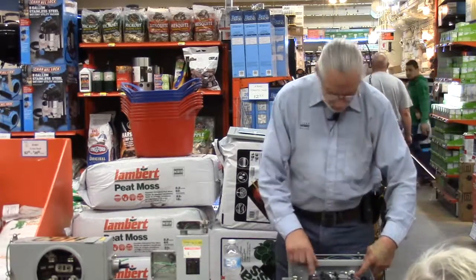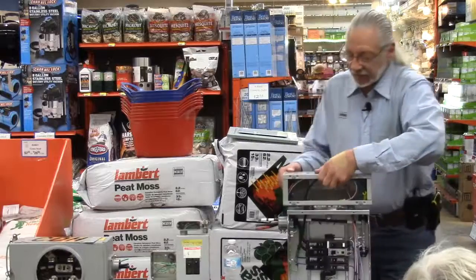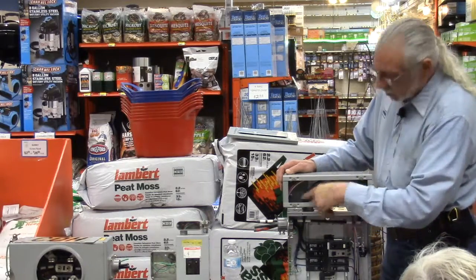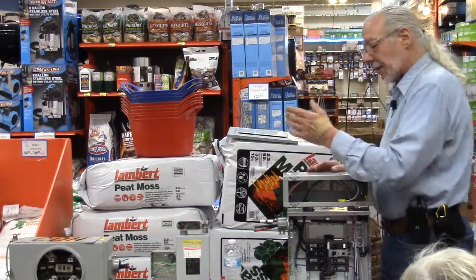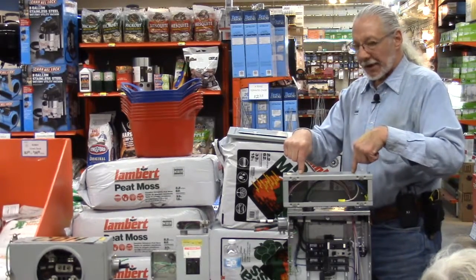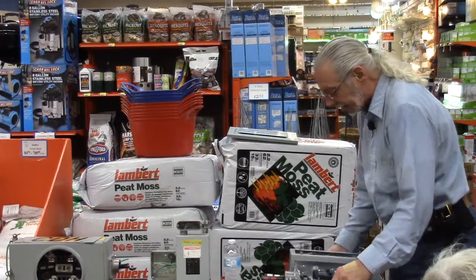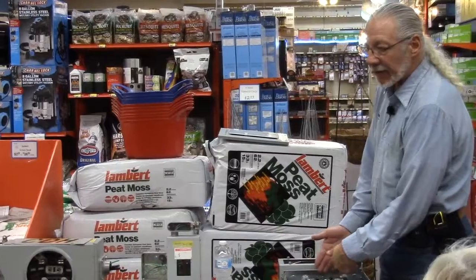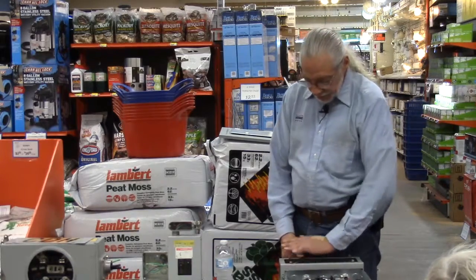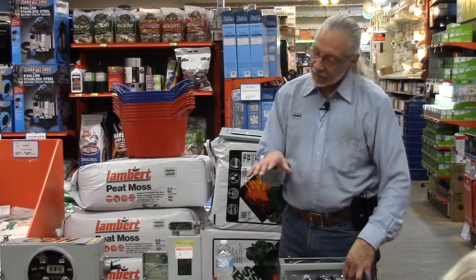I haven't cut custom holes here. All I did is get something close to what is coming in, because now I can jiggle my wires down the appropriate holes. Now, how did I cut these holes into this panel? Easy. I looked at about where I wanted the holes to go down into the new panel based on the holes coming in from my old piping, picked the closest holes I could, popped them out, and again took a piece of cardboard, made a template, and then put it onto the bottom here and cut the holes accordingly. So when I put this piece on, it just fit where I have the conduit extensions. But it's all careful measuring.